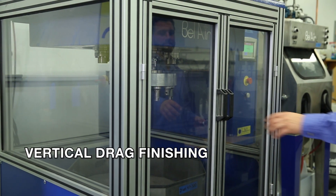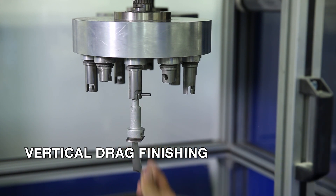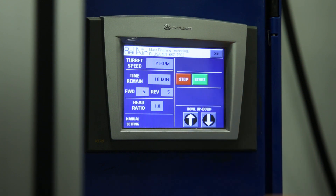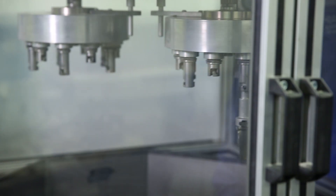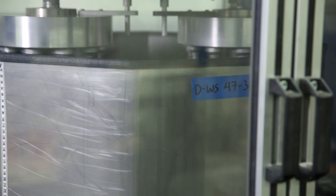The vertical drag finishing method results in a directional finish. It is the same expense as high-energy disk and barrel, with low maintenance as well. This is a batch process where a quantity of parts must be fixed on multiple tool holders. Drag finishing uses surface feet per minute of the media across the part surface, as opposed to G-forces of pressure, with labor usually less than 2 minutes per part.